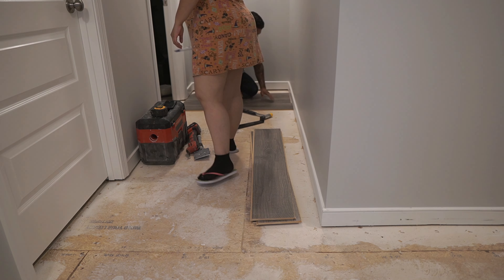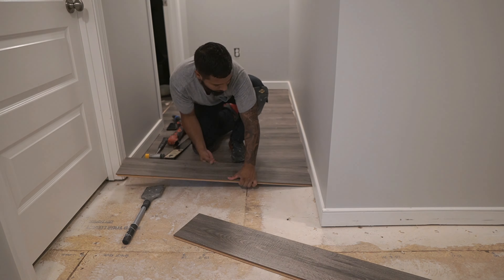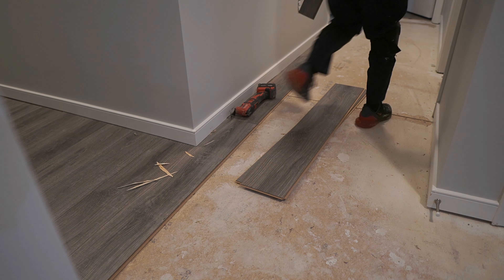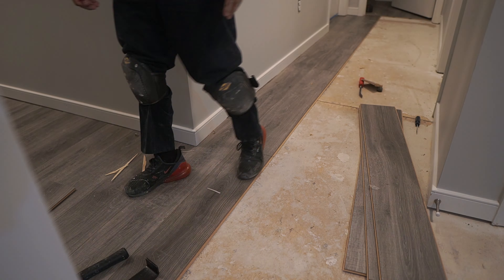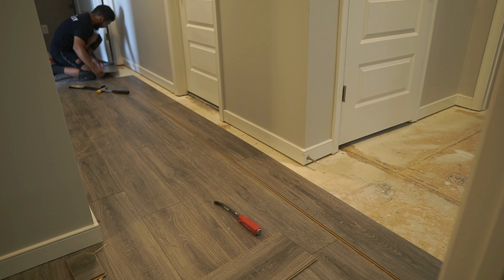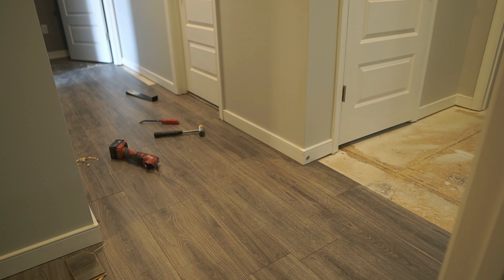Now on to my favorite part. Usually when I get to this step I just know the project's almost done — it's that much closer to finishing. Quick tips on the floors: quarter-inch expansion gap all the way around. I'm lucky these baseboards are actually kind of high, so my floor slides underneath easily with way more than a quarter-inch gap. Either way I'm going to use shoe trim to cover up the gap. I know some people don't like shoe trim, but I don't mind it.